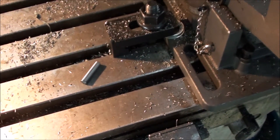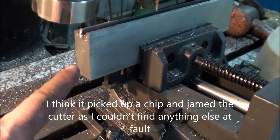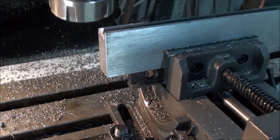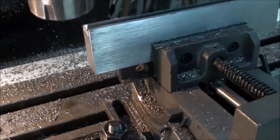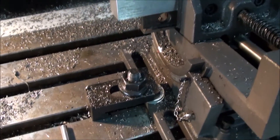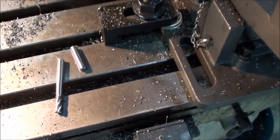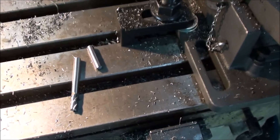I'm not sure what the cause of the bozo moment was. You'll see there's a little chunk out of the end here. It's cutting from right to left as we view it. I've just been working backwards and forwards, half a mill at a time — the same speed, same cuts — must have done 7 or 8 of them. And then all of a sudden, pow! There's the end of the end mill. So we'll change it out to another one and see if we can work out what happened. Better not break too many more of these because I haven't got too many spares.